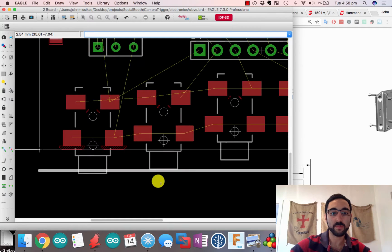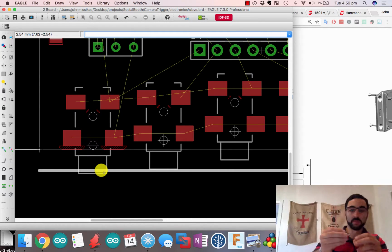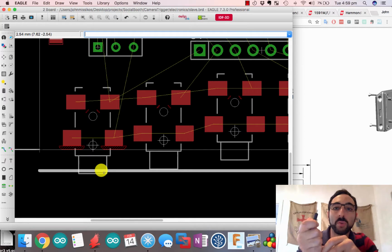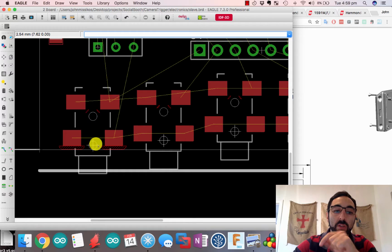So this is my headphone jack. I'll try and insert a picture of what that actually looks like. All right, so this is the 2.5 millimeter jack there, and this is the tiny surface mount headphone jack there. So you can see that fits together. I've got a little bit of a concern about the pulling force when you go to take it out. A little bit wary of that. It does have these little plastic lugs. So you can see on the board here and here, it's got these little plastic lugs to give it a bit more mechanical strength, but I'm still a little bit suspect.